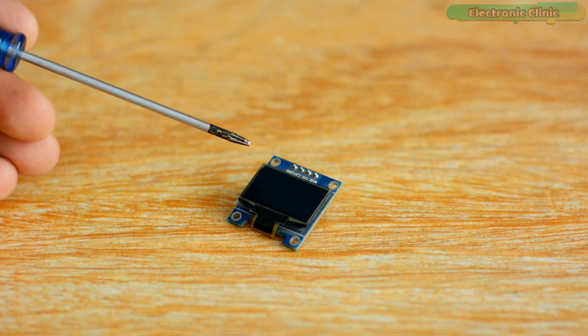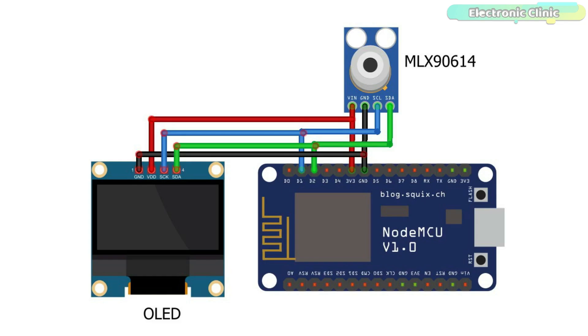The components and tools used in this project can be purchased from Amazon — purchase links are given in the description. These are the minimal connections you'll need to start with the MLX90614 and ESP8266. No external power supply is needed; you can use your laptop or computer to power up all the electronics. You can also use a LiPo battery, but it's good to have a voltage regulator that accepts a wide range of input voltages and gives 5V at the output.